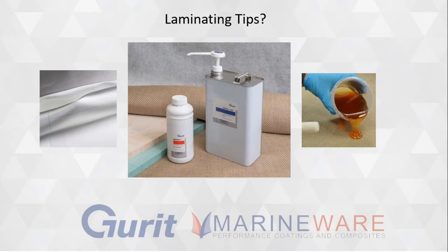Good question — I'm quite intrigued by this four-day overcoating window. If you're doing a larger boat and you're not going to sheathe the whole thing in one go, and you're getting to day three and close to your open window — in sunny England conditions — can we refresh it with a lighter laminate that we might be able to do the whole boat in a day, or even just roll a coat of resin on and extend that by another four days?